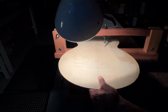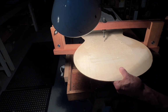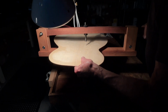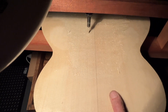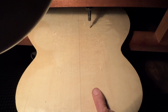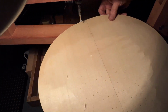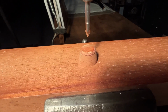And that we can sneak up on it so as to be able to make our own judgment about how thick this particular piece of wood really wants to be, you know, to do its job. Of course, one thing you have to be mindful of is to try and keep the plate square with the little anvil that it's sitting on the bottom. And in this tool, the little anvil has a nice piece of leather to keep it from marking the plate.